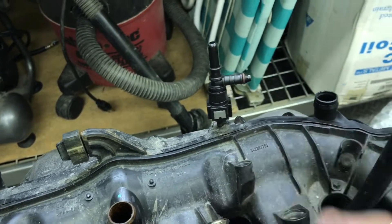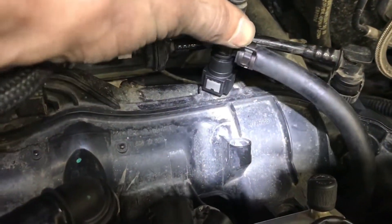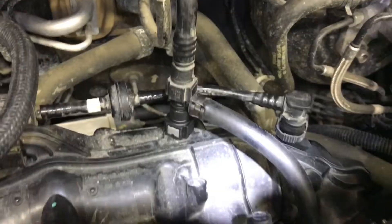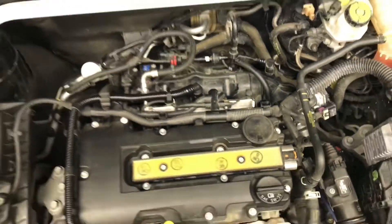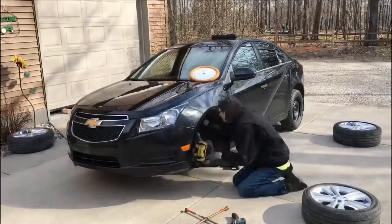Put your hose on with a hose clamp. It's a T brake booster vacuum connector — it's gonna go there, and this is gonna plug into there. I'm going to do this once I get it back in the car. Now I've got the hose connected to the T brake booster fitting, the brake booster plug in, and the whole manifold is back in.